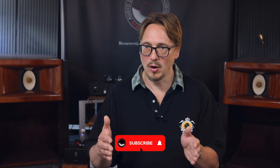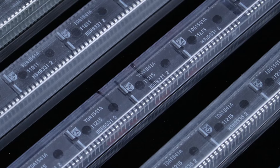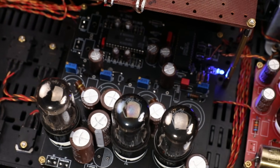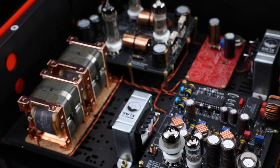Where we come in is the execution and implementation of that external oscillator feeding our TDA1541 DAC. The best sound was produced by an oscillator that was asynchronous and used tubes instead of transistors, with a tube power supply — that gave us the best results. This is all part of our DAC3, DAC4, DAC5, and DACX designs. We are the only company that commercially offers this solution in the TDA1541, with an external DEM generator that produces a superior, lifelike, liquid, organic sound that no other TDA1541 implementation has been able to produce.